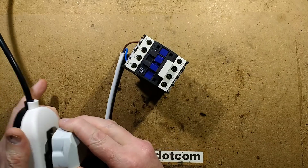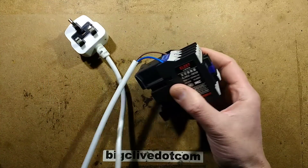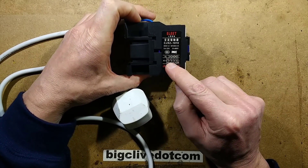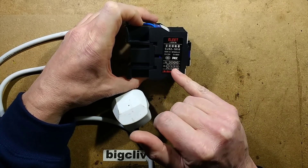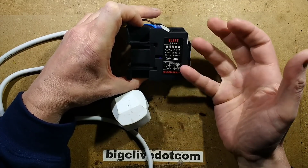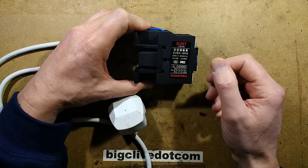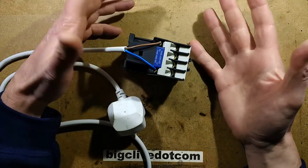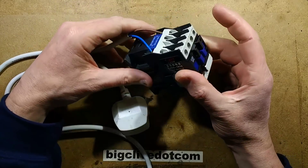Back together and working. You have to choose carefully for the loads. This thing is rated on the side: for 220 volts it's rated about 18 amps, 380 volts 18 amps, 660 volts 12 amps. I would always generally overrate a contactor — if I wanted to switch 18 amps I'd choose something rated much higher than 18 amps, because it reduces the load and wear on the contacts.